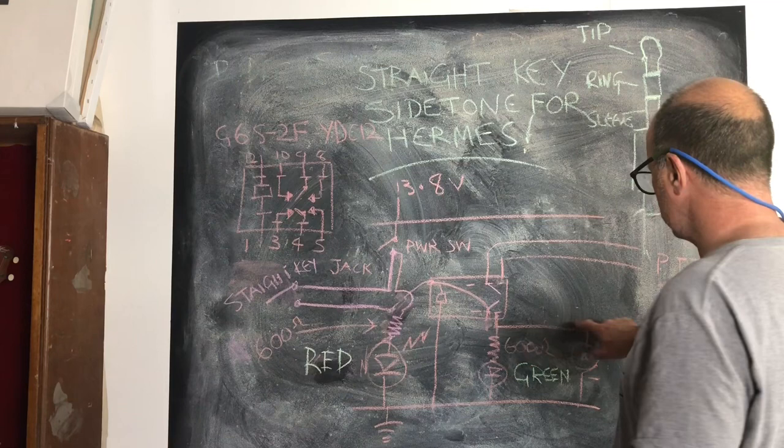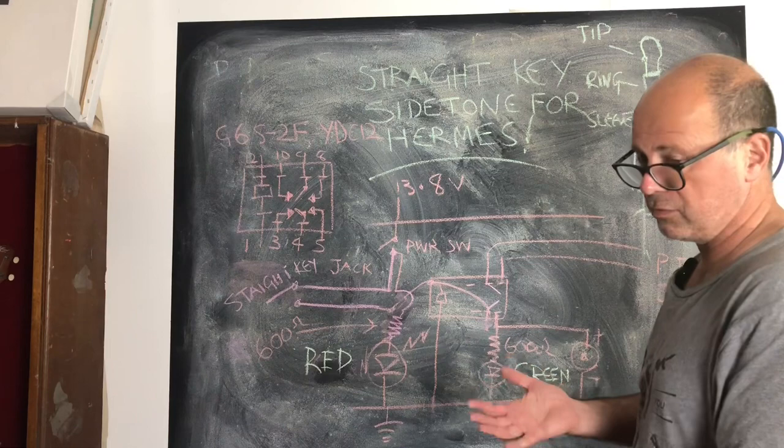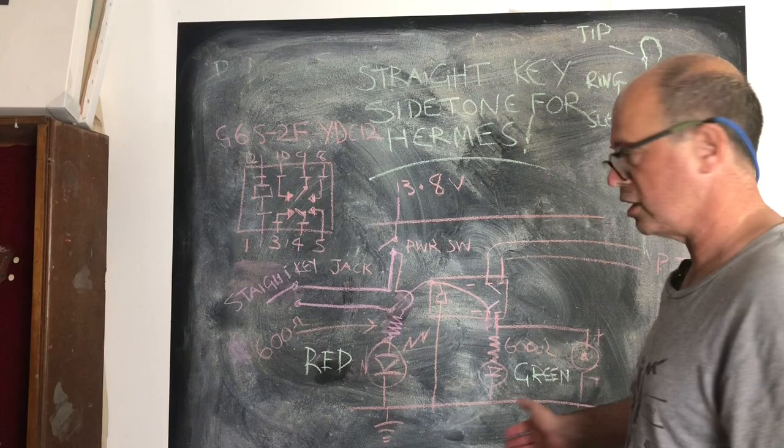And we also have our 12 volts going to the positive terminal of our piezoelectric buzzer. And if that's annoying you frequency-wise and whatnot, you could get a lower frequency buzzer, or you could just build yourself a 555 circuit. It's an oscillator, and you choose your components wisely to get the tone that you want. You could even make it variable tone if you liked, or you could use a microcontroller here. There's a million and one things you could do at this end of things.